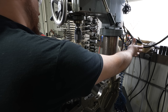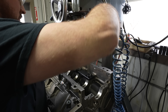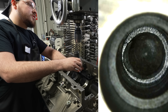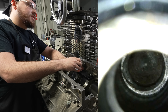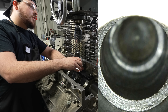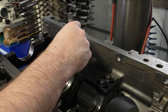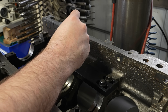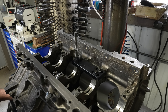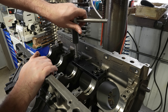I can see where the top part is counterbored, and then down at the bottom where it drilled to almost as far as the factory drilled it, but not quite. That went pretty well. Now we'll put some oil on that and go in and tap some threads. According to the instructions we're supposed to tap to that second line, level with the top of the drill bushing.